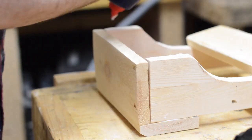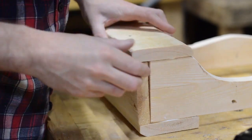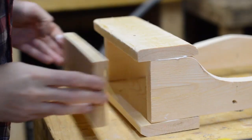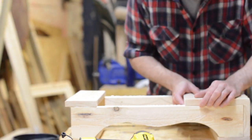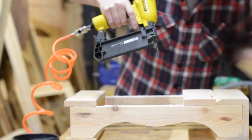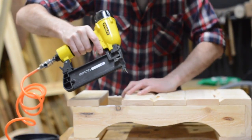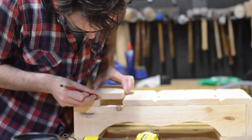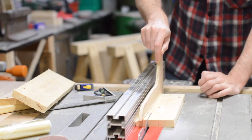I just held the top piece in place and then glued on the front piece. I want to come back later and hold the top piece in with some screws, as this is where the bulb is going to go and needs to be removable later. The back of the unit just gets a load of pallet slats — I told you this was going to be a rustic project. The last piece needed cutting down to fit, and I also need to leave a little gap for some frosted perspex to fit in to diffuse the light.